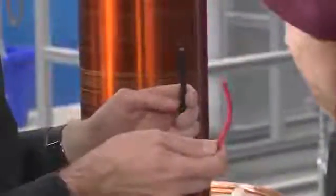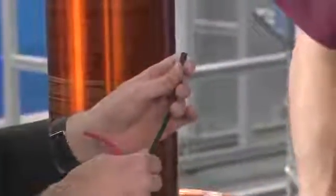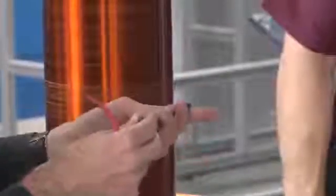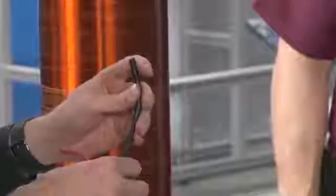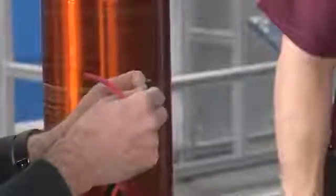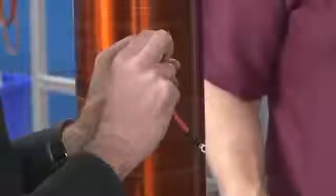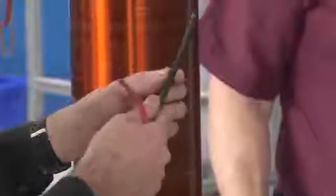Okay. And this is really tiny wire. It's like 20 gauge. This is, I think, 12 gauge. Looks like. Yeah, it looks and feels like 12, and it's not actual GTO cable. It's something different, but it's rated for 15 kilovolts. It's got a hard outer jacket and a soft, gooey inner jacket, and there may or may not be some shielding in there. I don't think there is. It doesn't look like it. Okay. There is not.